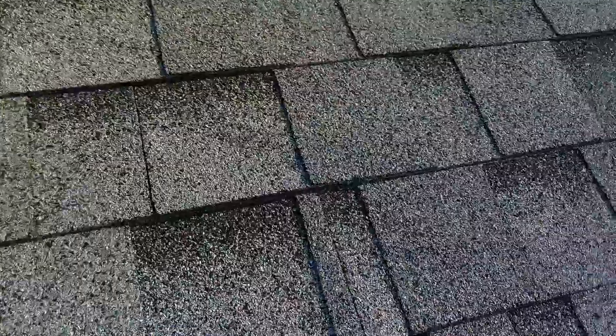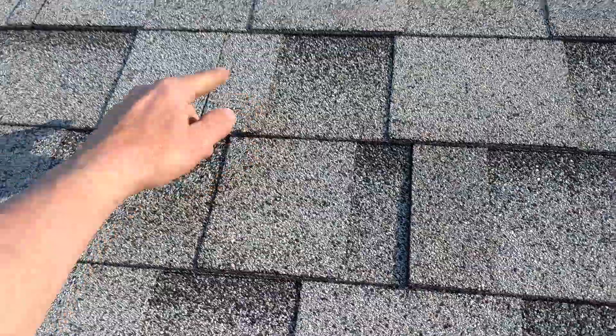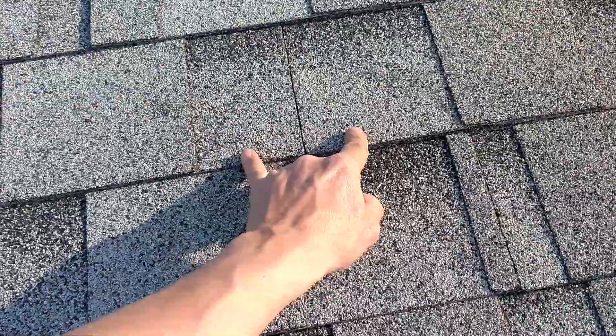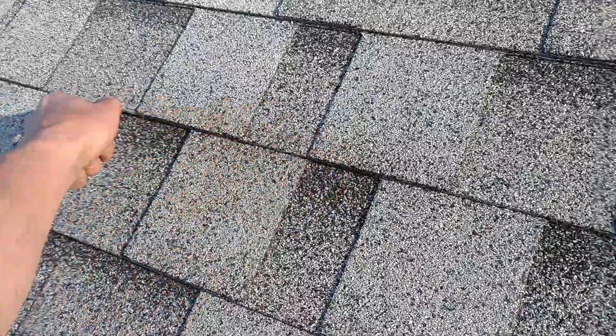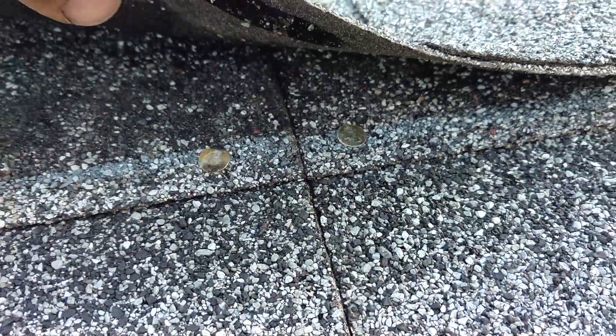Whether you're a right-handed roofer — most guys — or a left-handed roofer, that drip groove could build a stagger in this direction or that direction. Right-handed, it goes up this way, so watch that section. Sometimes if you bump a shingle over for various reasons, you don't want it in a drip groove. Then evenly space your other nails out throughout those sections. There you go — more proper, good nail placement.